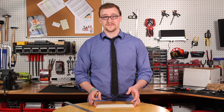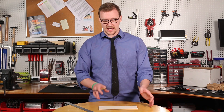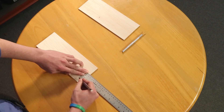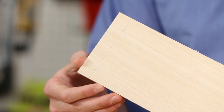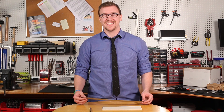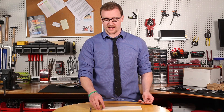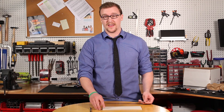After you've drawn your line at five and one fourth inches through the chassis, flip it to the other side and from one end of the chassis draw a line that is three fourths of an inch. On the same end that you drew the three fourths of an inch line, you're going to make a rectangle that is one inch from the top and that is five eighths by one and one half inch.